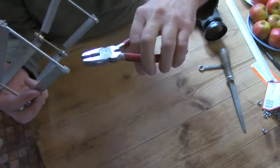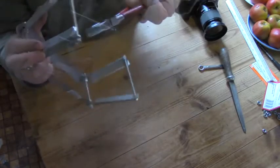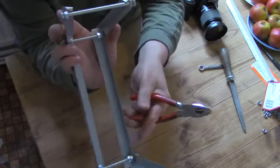Of course doing that, you've got a little bit of metal that sticks up — that's quite sharp. So what you do is get some pliers, bend it around your studding and there you can see it makes a nice flat surface, so it stands without being unstable.